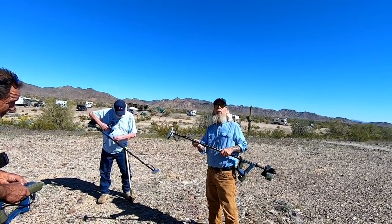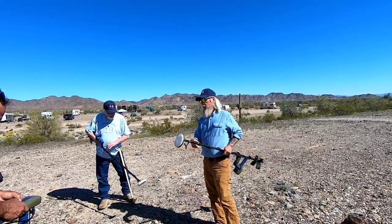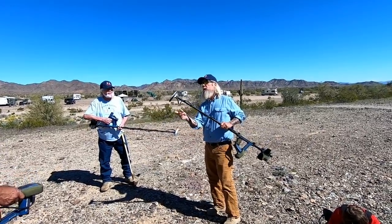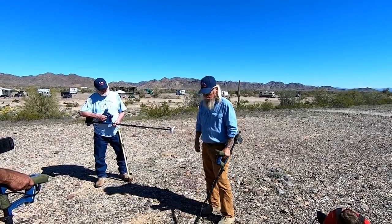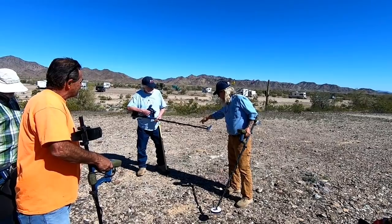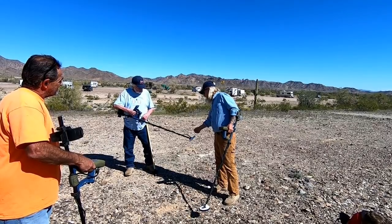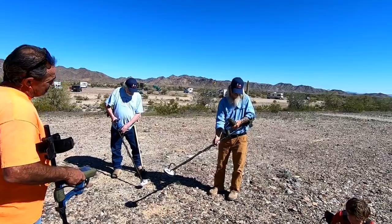What's inside this rubber? Metal. I can tell who's watched some of my videos and who hasn't by the way you're wired. The reason we do this is because this machine's so darn sensitive. If the cable is straight like this one is right now and it moves just a little bit, it's not pulsing at the coil. When it's loose like that, it will. It's seeing this move.